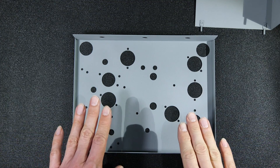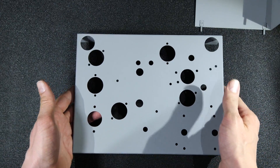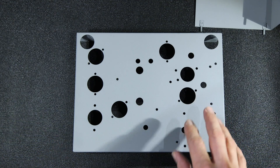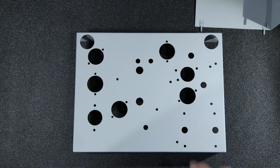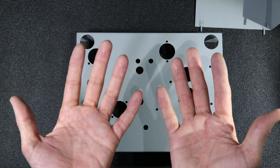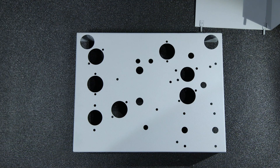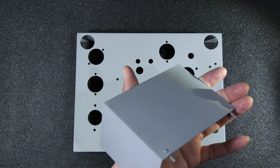Here's the chassis with the cold galvanizing compound on it — everything turned out really nice. At this point I'm pretty much ready to put all the components back in. I'll start with mounting the transformer and inductor, put the capacitor on, then mount that wiry mess on the underside back in and fold the tube sockets back down. I'll use 6-32 screws with stainless nuts and star washers to mount the tube sockets, so it should look really nice when it's all done.